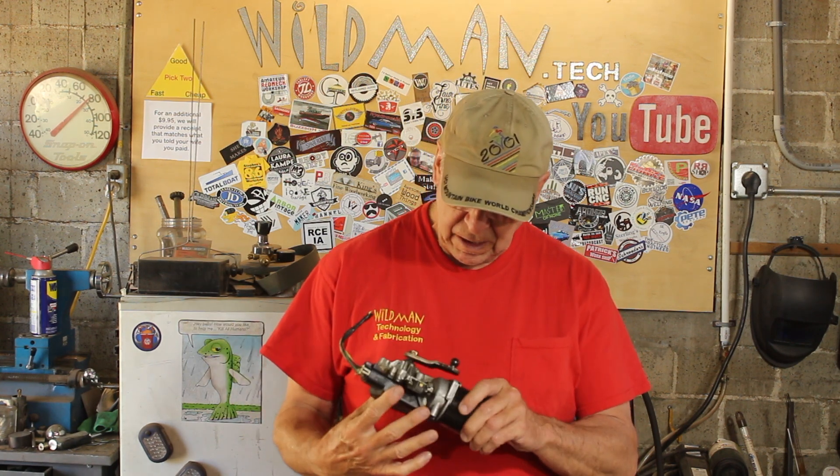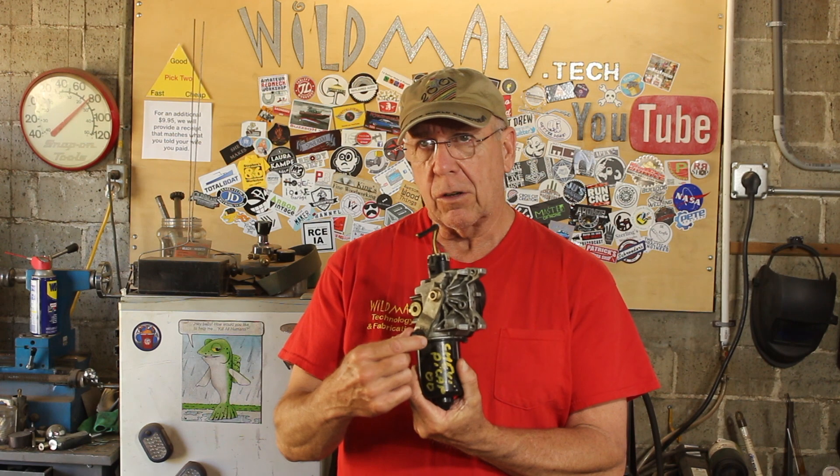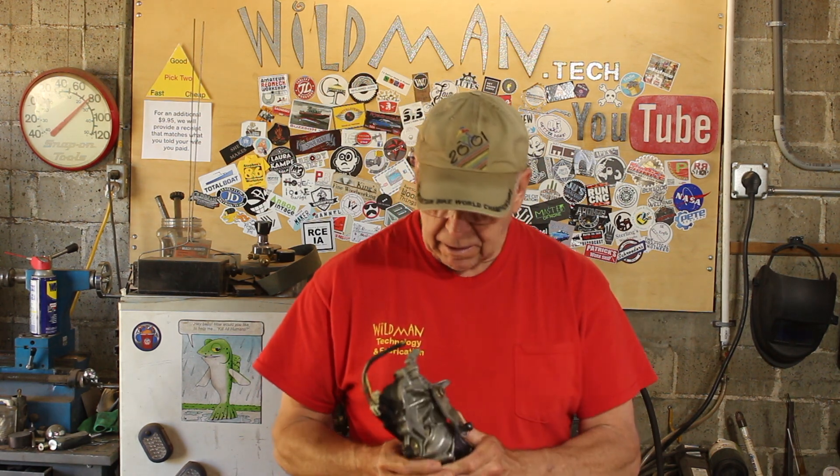It's the next day, and I've got a construction crew next door so they might generate some noise. I got a windshield wiper motor out of a Chevy Silverado 1500. I got lucky — it had the crank arm on it and some of the wiring, because this plug is really specialized. This one has an electronic pulse module inside the motor controller, and I think that's going to really come in handy. Because of the pulse module, I'll be able to use a potentiometer to vary the sweep rate. Since the mechanics of all of it is going to be easier, I think we'll start with that.